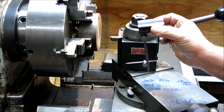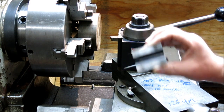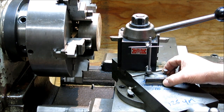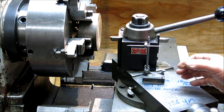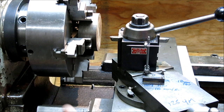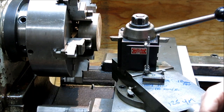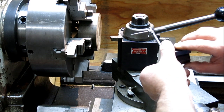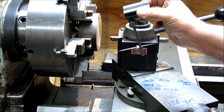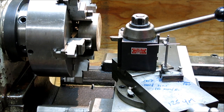It's doing this dynamically as you're cutting — constantly compensating with that bite and retract. The normal tool post creates what you'd call a self-reinforcing harmonic: it wants to dig in, and it gets worse when it digs in — it's just a snowball effect. With the spring tool, that force is relieved and everything's okay. It finds the sweet spot.